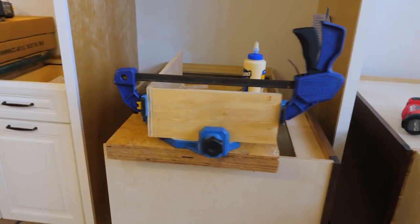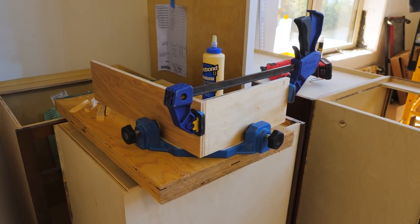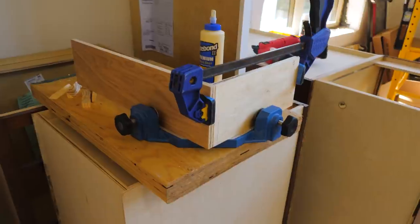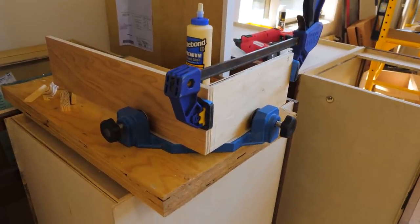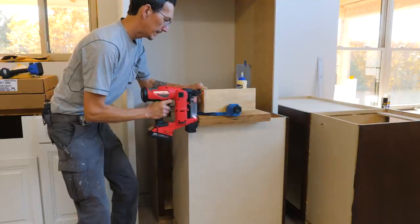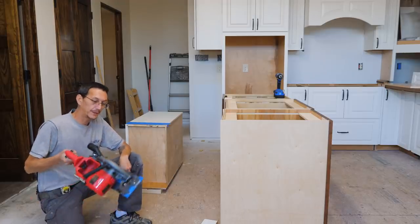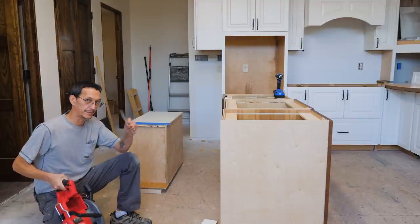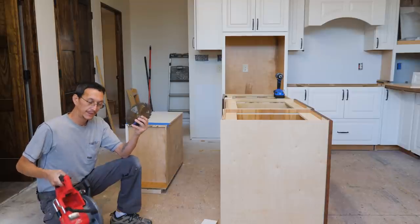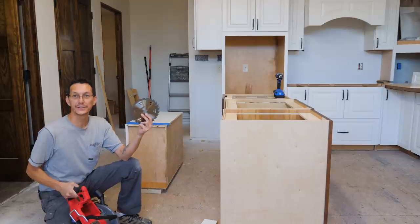I cut up a few pieces of half-inch to mock up a toe kick box corner piece — got it glued, clamped, and about to shoot it with nails. I wanted to test the new Milwaukee worm-drive saw on making this cut, but the blades are different — they've got this weird diamond arbor in the middle. This saw came with a framing blade with 24 teeth, and I need a lot of teeth for fine work like this. So I ordered a 70-tooth blade with the diamond arbor; that'll be here in a couple days.